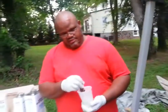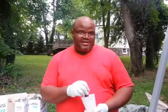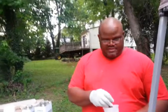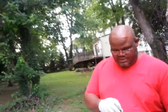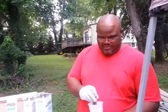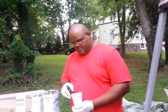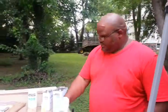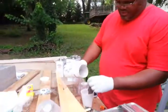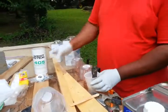So for the sake of TV, I'm going to say that this is about a minute. It's actually about 30 seconds now. And since I'm going to be mixing in some wood filler, I guess I could stop. You get the sides and the bottom very well, mixing vigorously. All right, then I get my wood flour, and we want to get the consistency of toothpaste.